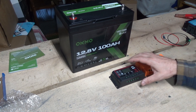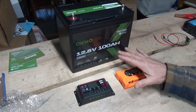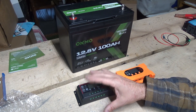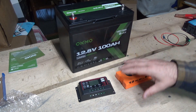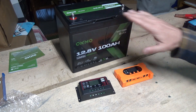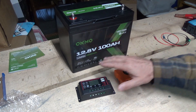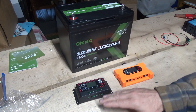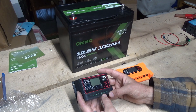Now the next step is to set up a solar charge controller. I have two of your average ones you'll find online here. For this small system, anything 10, 20, 30 amps — I'll go into a lot more detail on power inverters and charge controllers in a separate video. But right now let's stick with the basics and cover what's most important when hooking up a solar charge controller to a battery and then a solar panel. Notice I said that in a certain order — very important. You have to connect your solar charge controller to the battery first, and then connect your solar panels later. So I have two here, I just want to show you what a typical solar charge controller looks like and the markings on it.